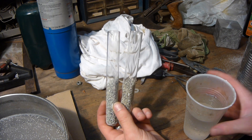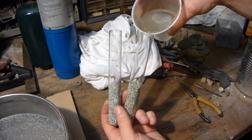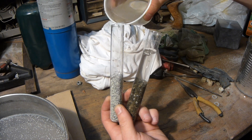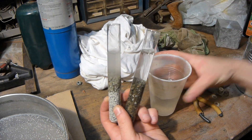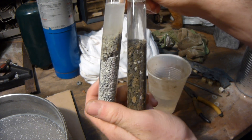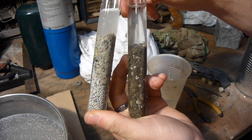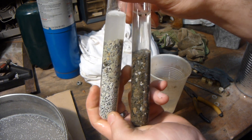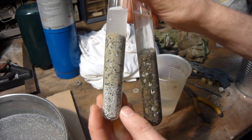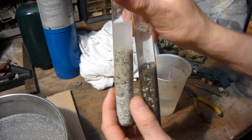It's a really simple test. All you've got to do is just add water. We'll add water to each one and you'll see the effect. Which do you think is bentonite clay? Look at that — this is your bentonite clay. See how it all clumps together? It'll sit like that for weeks and it will never actually wet the bottom down here, because it all expands up and basically makes it so that the water can't get past. It makes like a stopper there.